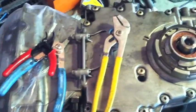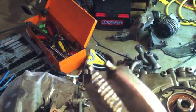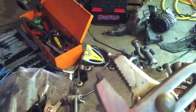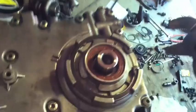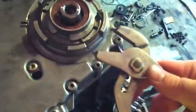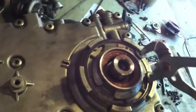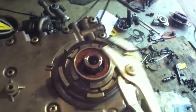They do make them wide enough — they make them with an adjustable piece sometimes. But I didn't have time to run out, and it's annoying when you don't have the tool you want. I keep every tool, I never throw tools away. I had an old pair of channel locks that I don't use at all. What I did was I took a grinder and just filed down just the tips of these channel locks to points — it probably took about four minutes, really quick. And now with my channel locks here, I can adjust it to any size I want, just adjust it here. It fit perfectly within those holes and I was able to put it on with no problem whatsoever.